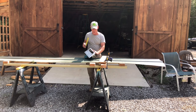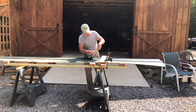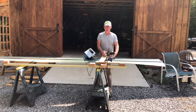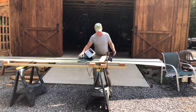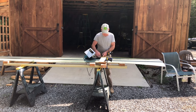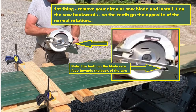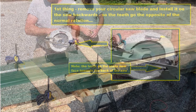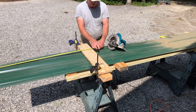Just a note: I'm going to use this edge of the board as a guide for the rip edge on the saw. Had I put this at 48 inches I would have been way off. I need to measure from the center of the blade to the edge of the rip fence — I've got an inch and five-eighths to the center of the blade. So I move the board back an inch and five-eighths to get a true 48 inches. That puts us at 46 and three-eighths. Double check: 46 and three-eighths plus five-eighths is 47, plus the one inch is 48 — so my blade will cut right at 48 inches.